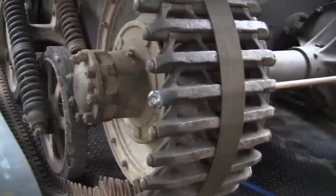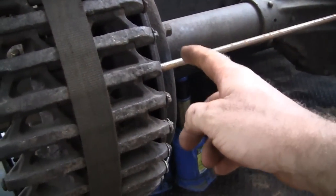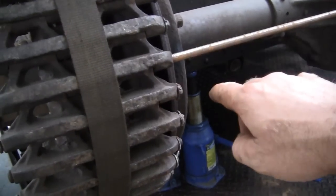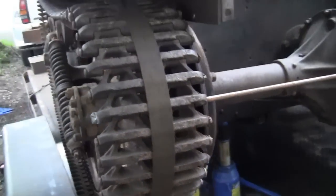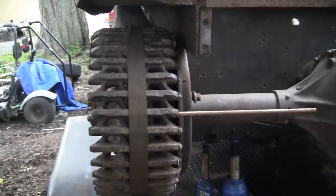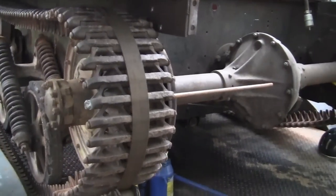She's not going to be a restoration job. I'm going to cut the other side off here. If you wanted to, it might be a bit hard to drill — grind a flat spot in there and drill a hole through it so you can put a pin like some of these other ones. Or just cut it off like I'm going to do, put a washer on it, done with it. That's my take on track pins. Want to leave a comment down below how you do it? I'd be happy to hear it — the more info the better.